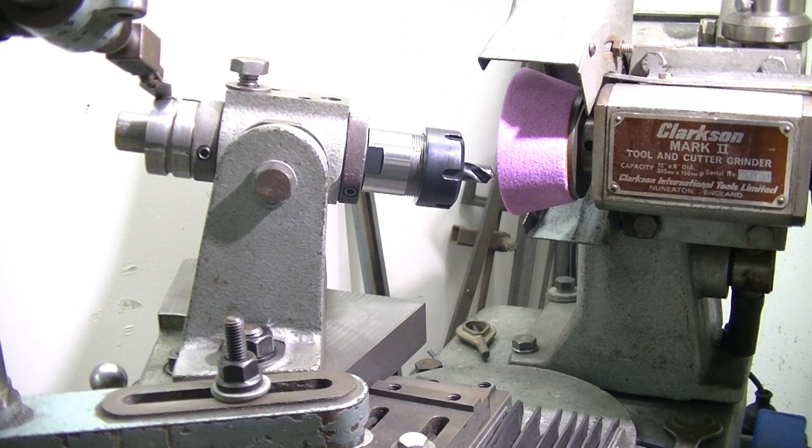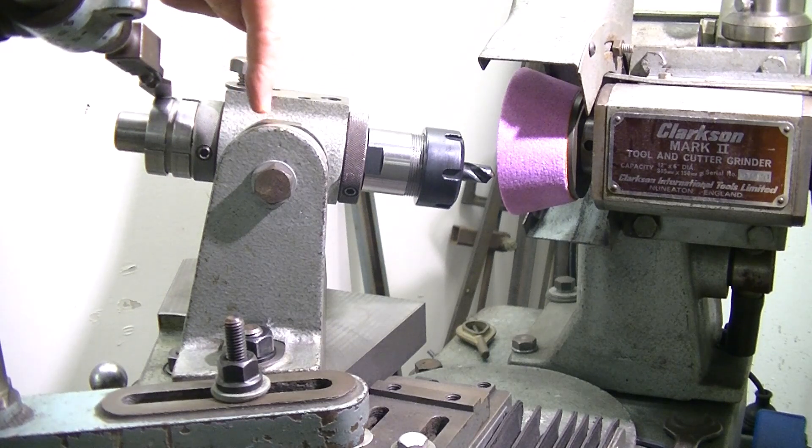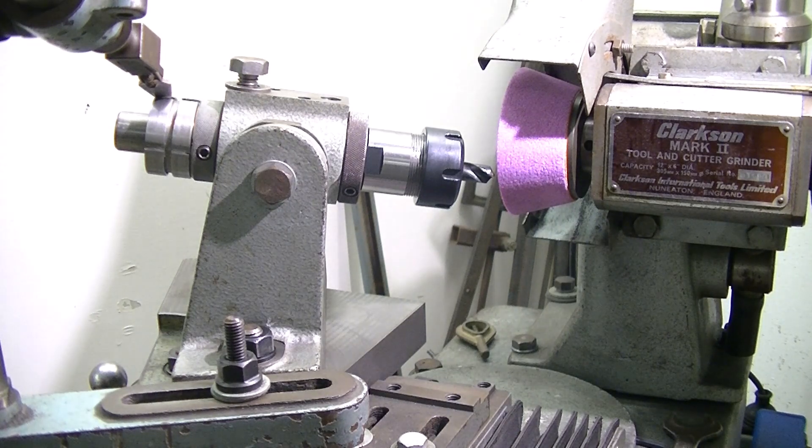Okay YouTubers, here we are about to start four-facet grinding on a 12mm drill. We have the original Clarkson work head with an ER32 collet. I've set the angle downwards by the angle gauge on the head, and I'm grinding off the edge which I don't like, but I can't reverse the Clarkson to grind in the other direction — so that will be a problem, but we'll see what we come up with. It's 10 degrees on the first facet. I did try and use the indexer but the long screw on the back interfered with it, and I've spent too much time already — I've forgotten how I did it last time, just too many projects. I'll turn the camera off while I get power going and then we'll start to grind a four-facet drill.